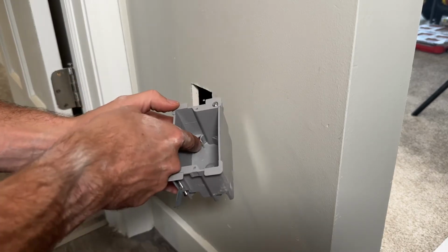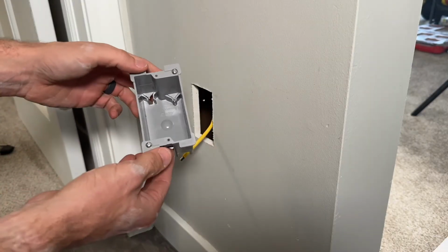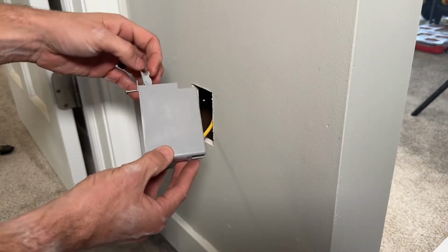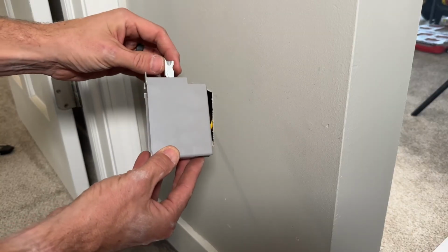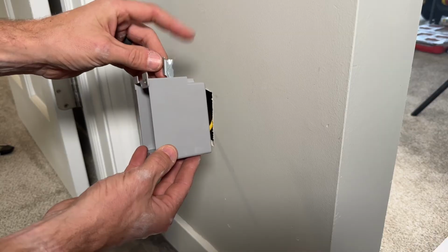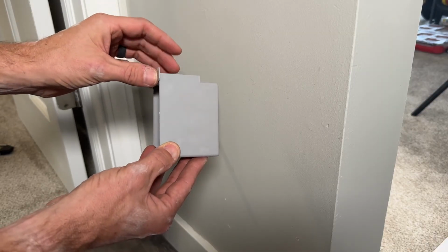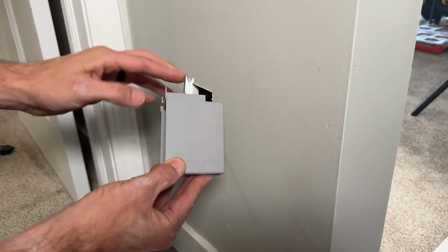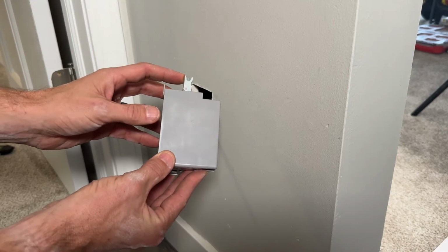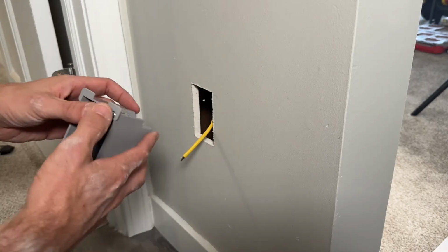I opened up one of the pass-throughs here. I like this old work box more than your standard blue ones that have the plastic tabs. This is made by Legrand. You'll find a link in the description right below the video to this exact one. I like these metal tabs, and also they can open up a little wider. So if you have plaster walls, they can actually open up wide enough to work within plaster walls, in addition to holding on standard half-inch drywall as well.